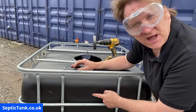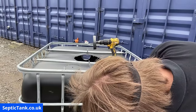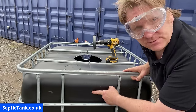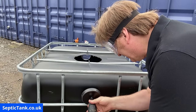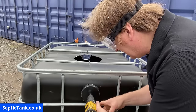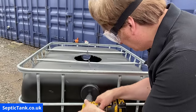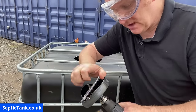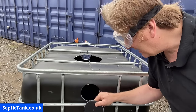That mark was the height of the center of the original hole, so we only need to go three to five mil above that. X marks the spot — that's the principle of how you do it. Once you've done that, get your hole saw, locate the X, press the trigger, and there you go — we've made penetration. Then just make your second hole. The plastic usually gets stuck in the plug, but it really simply comes out. That's how to make your inlet and your outlet.